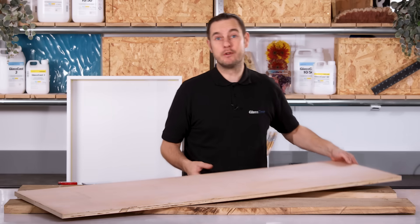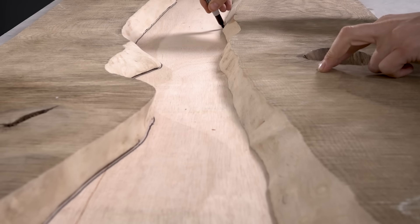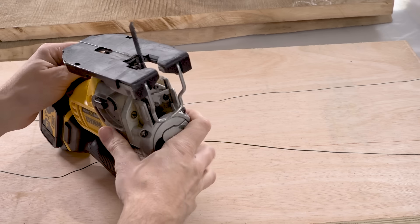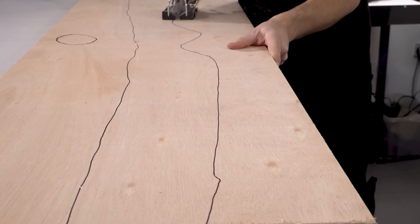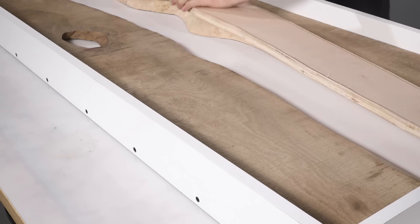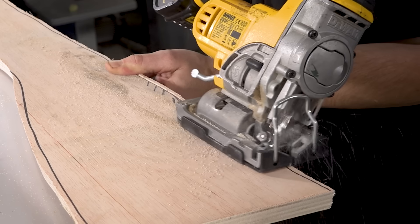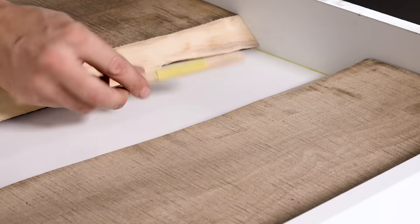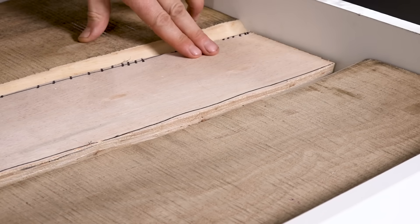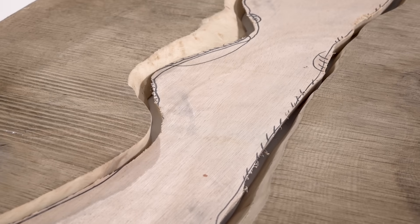So let's get this plywood cut down to the rough river shape. I'll start by transferring the profile of the waney edge onto the plywood — we want it to fill the river up to the live edge as snugly as possible, leaving around a 5 millimetre gap. To accommodate the angle of the live edge I'm setting the jigsaw to match that angle, and cutting about 5 millimetres wide of the line to account for the taper. With the rough shape cut I'll offer it up to check the fit and make any adjustments. Here I need to cut at a sharper angle to better match that live edge. When checking the fit I'll prop the plywood on lollipop sticks to simulate the bottom 5 millimetre layer of resin. The fit doesn't have to be perfect — as long as we're aiming for at least 5 millimetres all the way round we should be good.